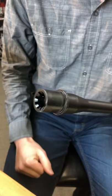You're going to want to put a little bit of grease around the actual barrel extension itself for sliding it into that upper receiver, and you're also going to want to lubricate the threads of your barrel nut and/or the threads of the actual receiver itself.